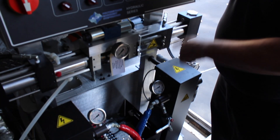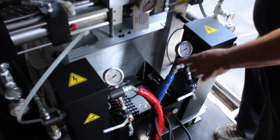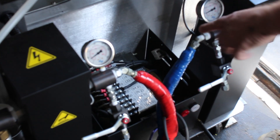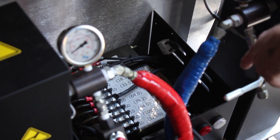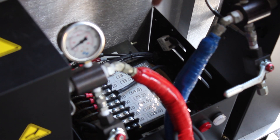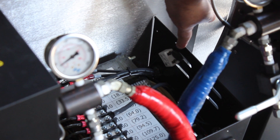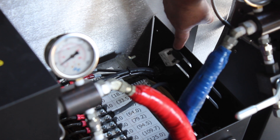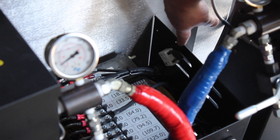With your control power on, that red light on the bottom of the hose transformer — which on the classic machine is right in the front in a box between the two heaters — if that red light is not on, here's your inrush current limiter. If that inrush current limiter is burnt up, you have to remove it. I'm going to show you how to jump that out to continue working.